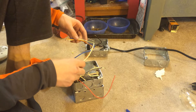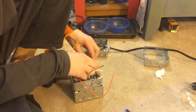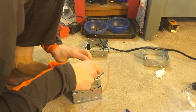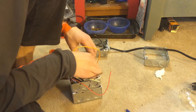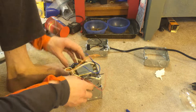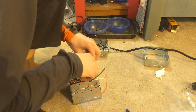We have the second common right here. The blue wire is for the igniter, just to let you know. Not all ballasts — this ballast kit I have, this brand, is color coded like this, but not all ballasts might be like that. So don't always follow what the wires I am showing here. Read your diagrams if they are different colors, or read if they are labeled like 'cap' and so on. Then do it that way, because you might have a different ballast brand and it might have a different label.